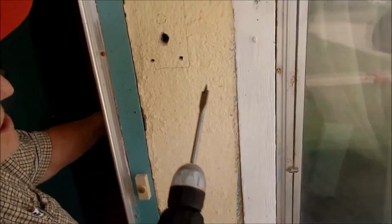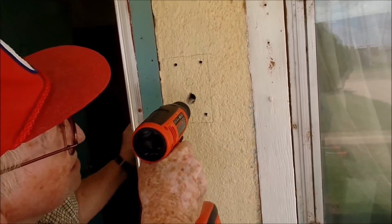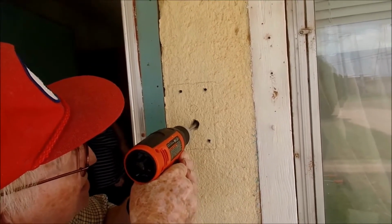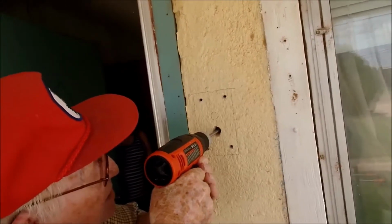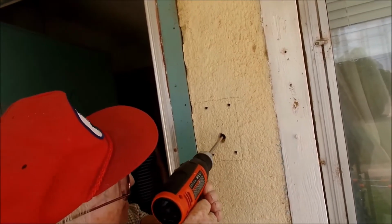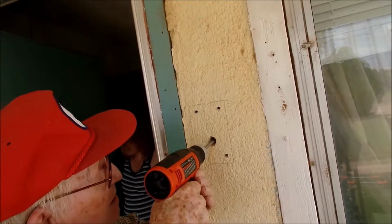Half-inch. That's a 1/2 inch size, which is more than enough for the size cable that we have. Plus, this one's going to take out a lot more wood, and having the pilot hole in there to guide it through is a very important thing. He's taking his time through it and doing the start and stop, partly because he's feeling for the wires himself. He also knows that if you just go in there really fast with it, you're going to burn wood rather than cut wood.